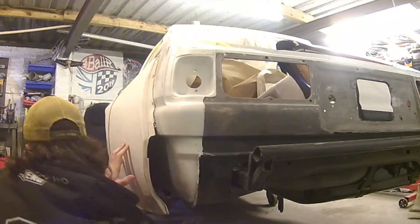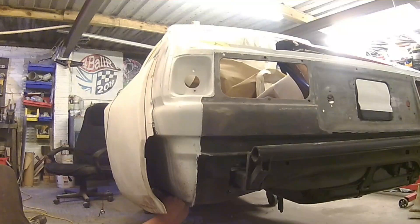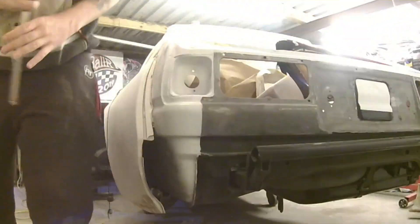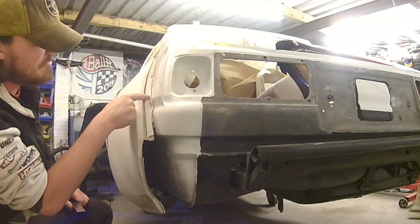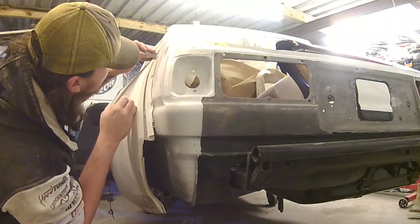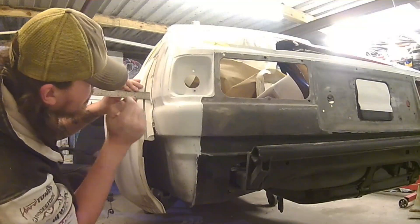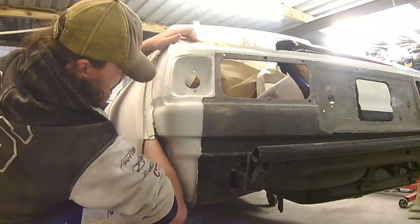Right — oh, I'm getting too old for this! Then that should... just grab a tape measure. So on the other side we've got 10mm up here between this face and the edge, roughly. And at this point here we've got roughly 40mm. Let's have a little look here. That's about 10mm and that's about 40mm. So that is now in the correct place, give or take a couple of mil — you won't notice it in the end, hopefully.